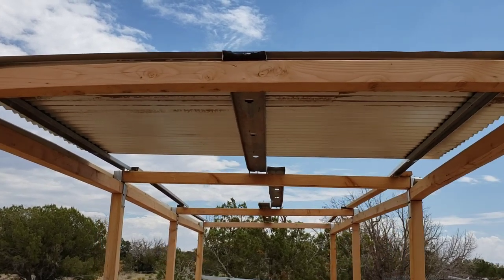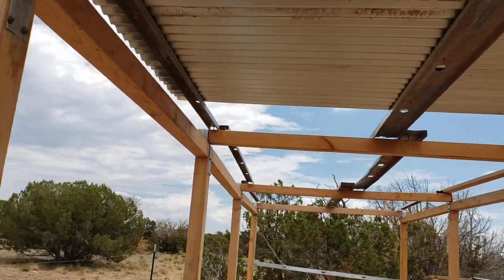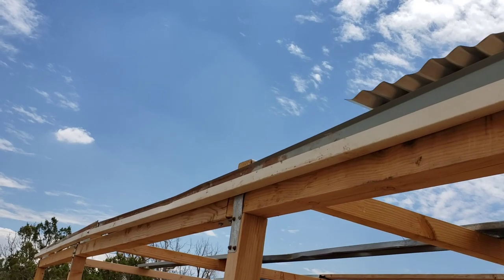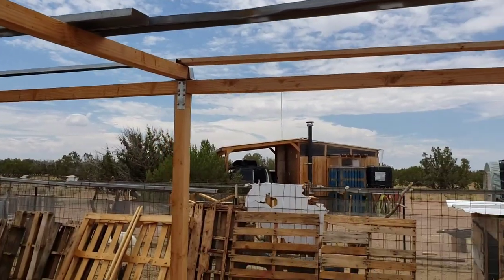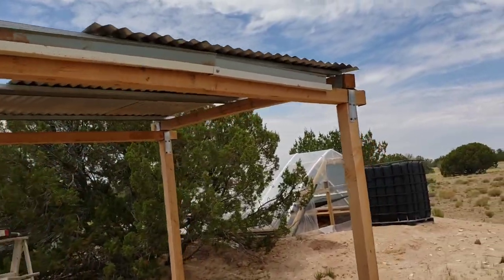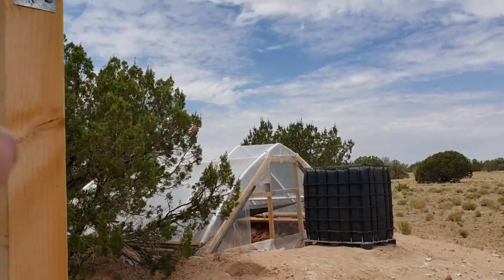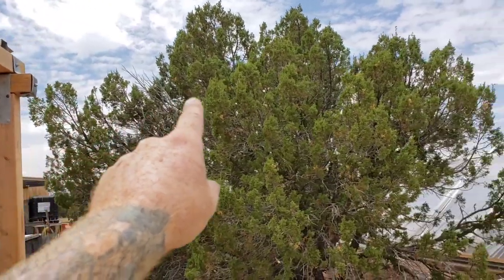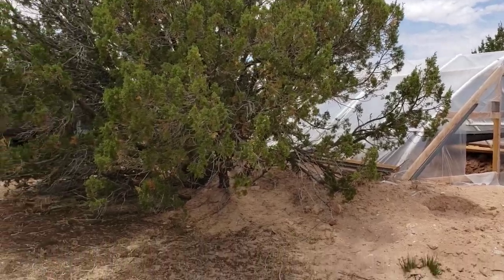The battens make it easy to attach the corrugated steel to the roof, and I already lined up this piece of flashing. I used one of these on the shed over there as a gutter, so I've got that pretty well lined up. I've got enough four-inch corrugated collapsible tubing that I should be able to wrap it around the edge and, if I can support it, get it all the way over to the tank before it rains tomorrow.